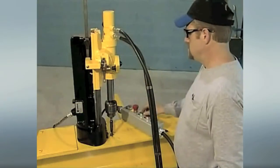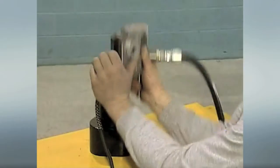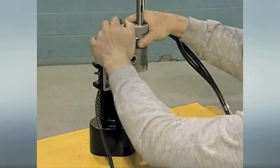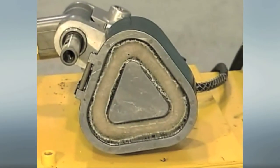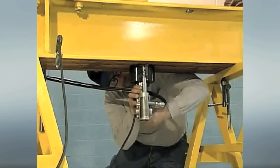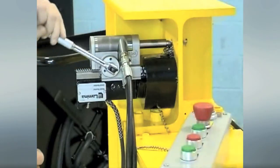The three larger spindle heads can be operated in automatic or manual feed modes. The smaller sized hand feed heads and stub models are versatile, with a spindle that can be removed and reversed for drilling upward. Stabilization is from below at the magnetic base, which attaches to the drilling surface at almost any angle, including vertically and horizontally.